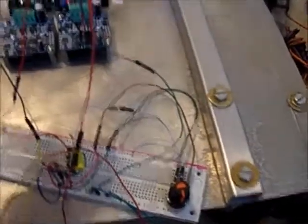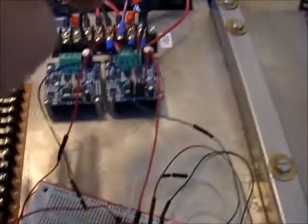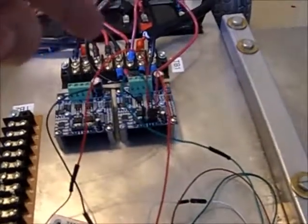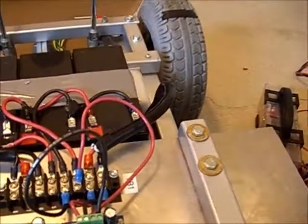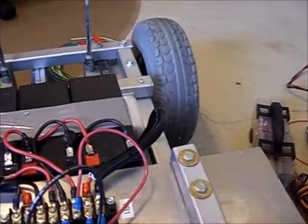This is my test setup of the motor drivers I purchased recently. They can supposedly withstand 30 amps at 15 volts — maybe 24, I don't remember. I made a pulse width modulator circuit using just a 555 timer, it's real simple. I'm going to apply five volts to the circuit right now. The motor is humming — I think that's because of the 555 component values — I have to change those. There we go.